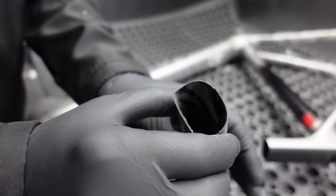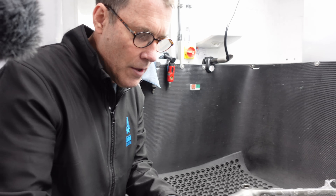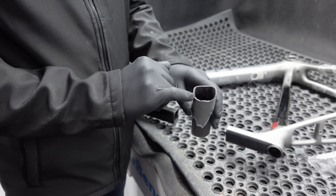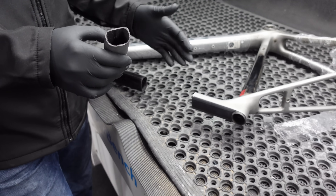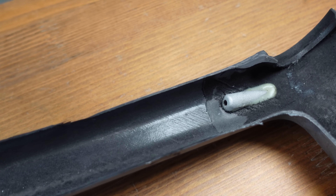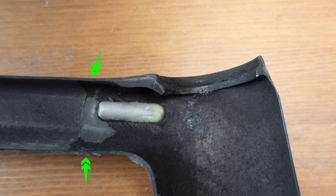There's no jam in that sandwich, so I'm pleased having taken a risk and cut my own repairs up. What we are seeing here is a varying carbon thickness along the top tube, which is a technique used to save weight. The carbon is thicker around the seat tube and towards the head tube areas, and in the middle it's thinner because there is less strength required. This also shows us why we shouldn't really be clamping our top tubes with our bike stands.